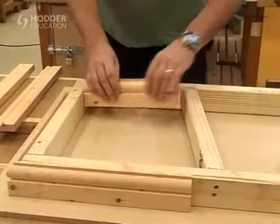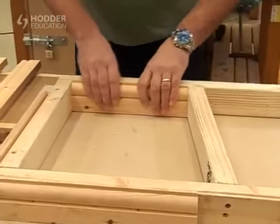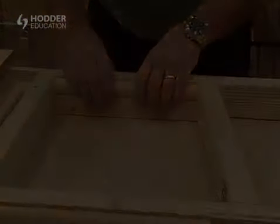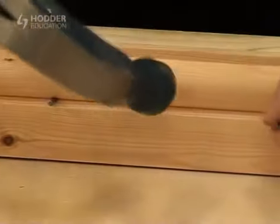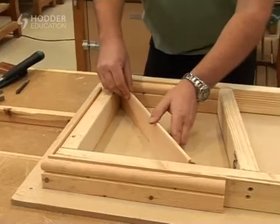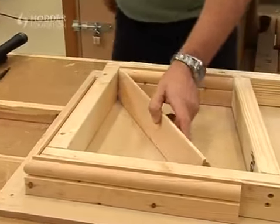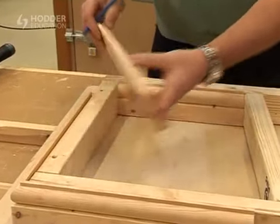Place the cut length of skirting in position and check the abutment to the other sides to ensure no visible gaps. Secure the skirting in position with several nails, leaving the head slightly raised. Place another length of skirting against the secured one and indicate the direction of the scribed joint with a pencil mark.